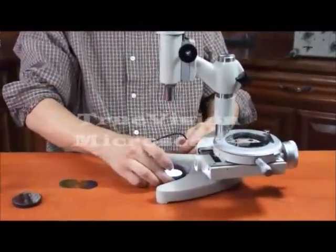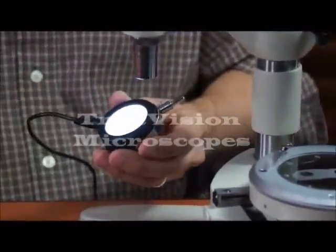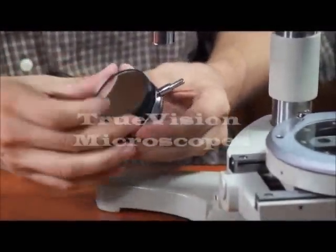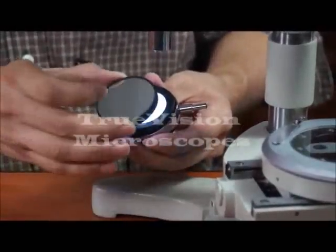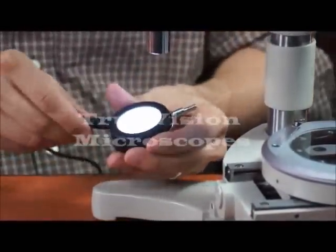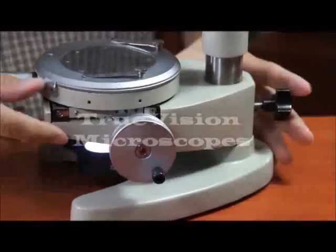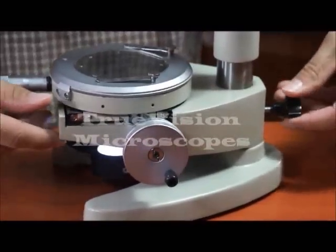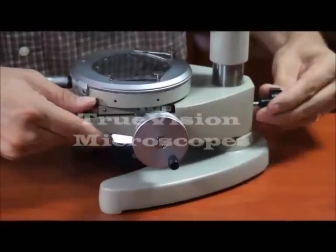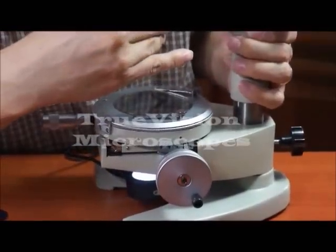I'll show the LED illumination. One could take off the LED and insert the mirror illumination, but I wouldn't want the mirror illumination — I would always use the electric. This metal bracket can be pulled off. You want to tighten it down so it doesn't rotate out of the optical path. You want the light directly below the stage, so rotate everything so it's in place, including the head — rotate the head so it's right above the light.